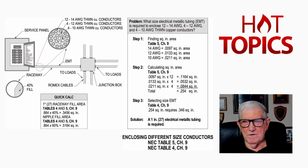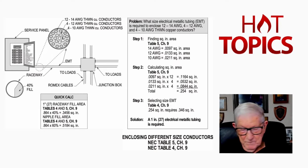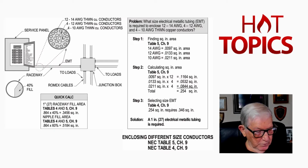So we kind of pick that up, and then we want to know how many current carrying conductors we have there. And the only time the number of current carrying conductors becomes an issue is when it's a Y system, 277/480 or 120/208. So now if we go back to our 310.16 and 310.15, we can pick up these rules. So let's just go over to 310 and take a look at 310.15(E), I believe it is. 310.15(E), as in Ed, and we would find that on page 160.